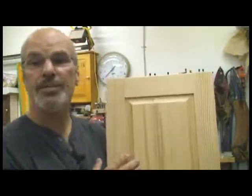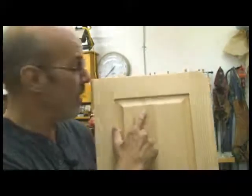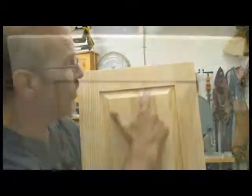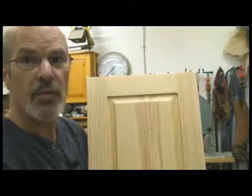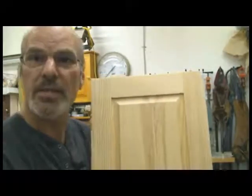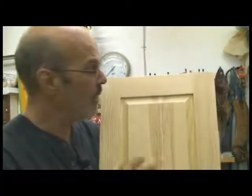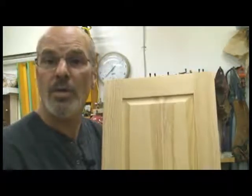When you look at this panel, there's something else. This panel has nice grain coming up one side of it. But if you look at the end, this flares out this way, and then the grain dead ends — it doesn't look right. We flip the panel over, and this side doesn't look too bad. You've got a flare going this way and a flare going that way. That looks rather nice. But the bottom doesn't look uniform. Same with this rail — it doesn't match the stiles. Simply put, we paint with grain. We envision what the piece is going to look like before it's finished with the material that we have. And if need be, we'll go out and get more material. Now let's go over and take a look at the bench where I've got a piece mocked up.